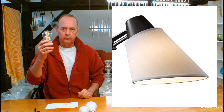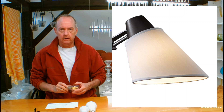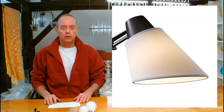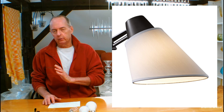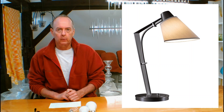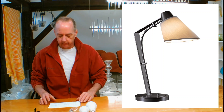I'd probably hit Home Depot, Lowe's, or a True Value hardware store and pick up a couple of 200-watt equivalents — those would probably work very well. Make sure they're dimmable, because there is a dimmer on this fixture. Color temperature is also going to be important. Bulbs are offered in 2700 Kelvin, which is a super yellow light. They're also offered in daylight, which sounds warm but is actually a bluish-white — like an overcast day or a hospital waiting room — around 4,000 to 5,000 Kelvin. What we like to use in our showroom is warm white or soft white LEDs at 3,000 Kelvin. They mimic the light of an incandescent bulb and give a nice warmth.